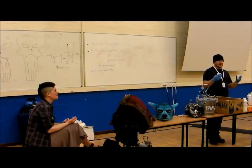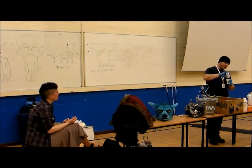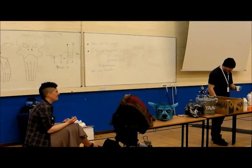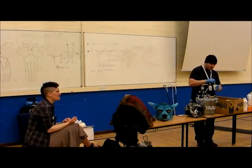Resin comes in two parts, like we've said. One part is significantly thicker than the other. Normally it's the yellow part that's the thinner. Put the thicker part in one cup, and pour the yellow part in because it's thinner. That's why I keep telling you to get the easy flow, it's better, it does flow easily. Mix it over the box. I do not want this on the floor.